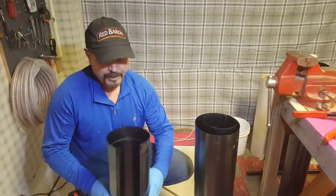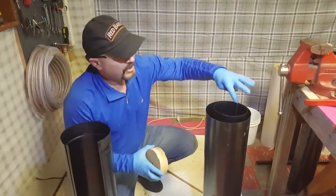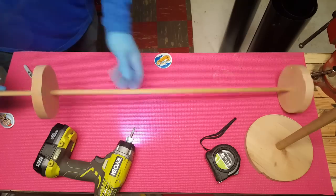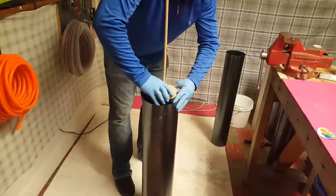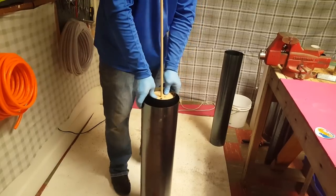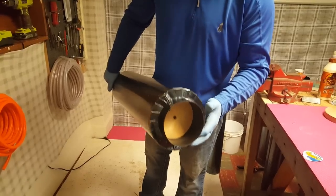In order to maintain a perfect circle on our inner pieces I had to build another tool. I do that a lot — if I don't have the right tool I just build a jig. I've got some five inch circles that are cut out to hold it in place. I made it a good tight fit and — just like that. Now I've got to get the top one to go in — there we go. That will make sure that we maintain a perfect circle, and the last thing we want is to have the concrete set up in an oval shape.